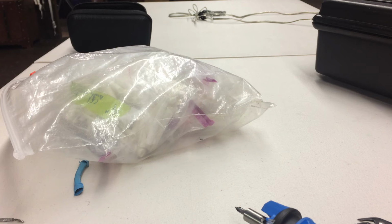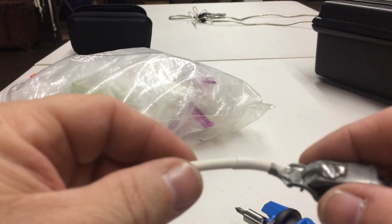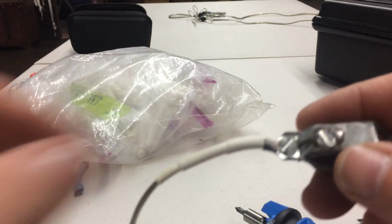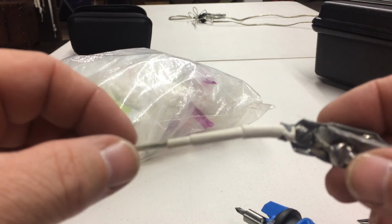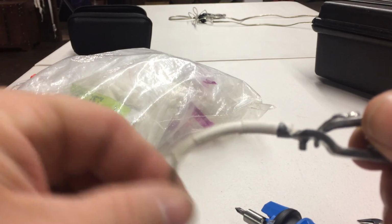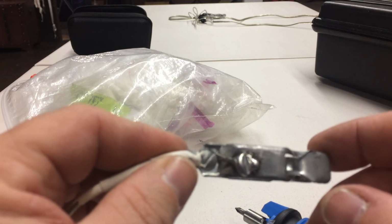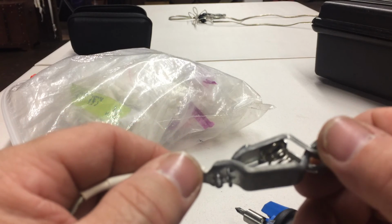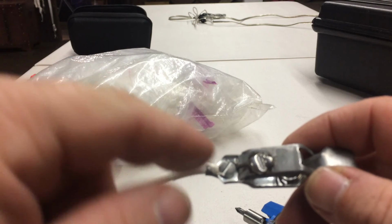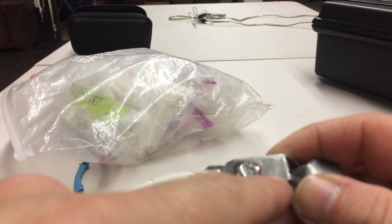Okay, let's talk about the A-line for a second. On a foil and saber cord, the A-line is the alligator clip. Now, this goes to, like I said, this pin here. That's the A-line. And if you notice what I have here is I have 3 layers of heat shrink, one of each of the size I mentioned earlier. And that purpose is to minimize the bend radius, so it doesn't get a real sharp bend right here and break the wire. The wire must be visibly soldered to the clip, as this is. But also, the thing I do on it is I buy Mueller brand clips, number 27. That's the model number. And they always come with this screw here. I'll take the wire and I'll run it under the screw, crank it down tight, and then I'll run it to the top here, and that's where the solder joint is.